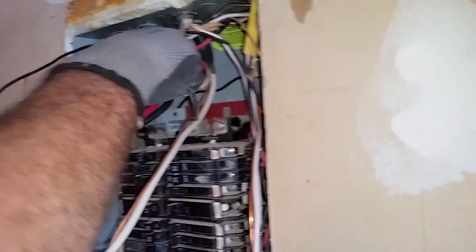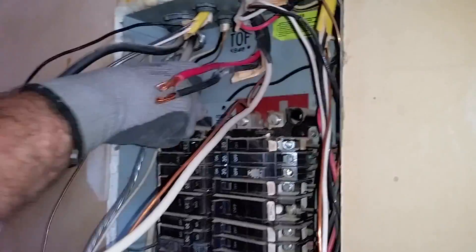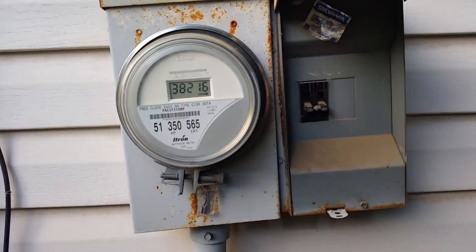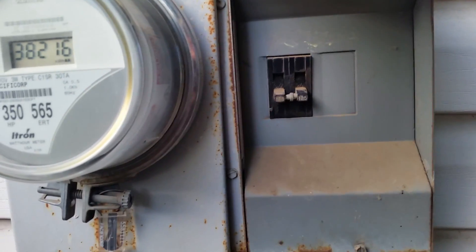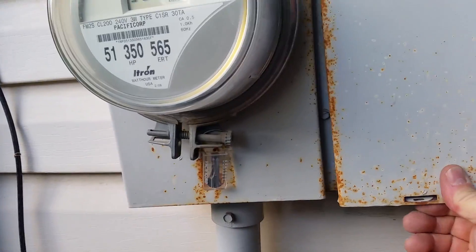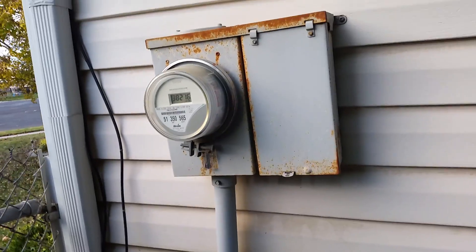We're going to have to extend some of these wires, or cut our hole up higher. Just getting all the wires out of the way so we can start taking the connectors off. Definitely the most important thing you need to do is come out and turn off the main power — we'd already flipped that off, but it's very important. Technically you should have lockout/tagout on that, or have it in a controlled area where no one will come and turn it on while you're working.